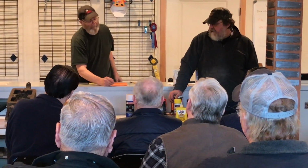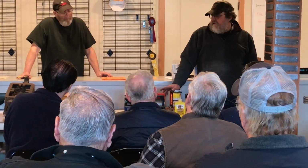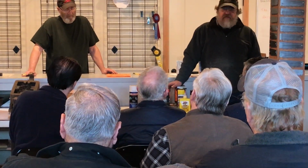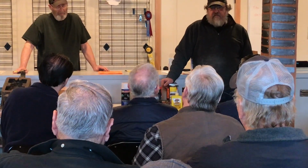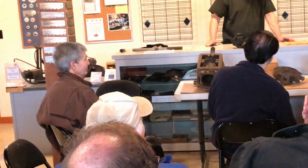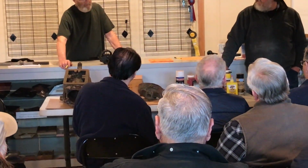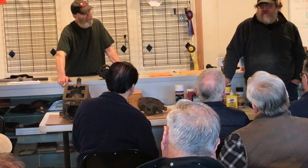So that's kind of my technique on unsticking stuff. If I've got a part like that head, the first thing I would do is I've got a caustic soda vat. I would soak it in the caustic soda, and that gets rid of all the grime and the dirt. So that way you're not fighting the grease and the oil. You want to get down to the bare metal to get it unstuck. It'll flash rust after that, but then the next thing you could use is electrolysis.